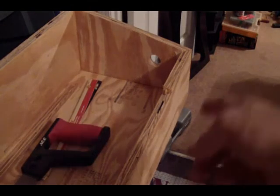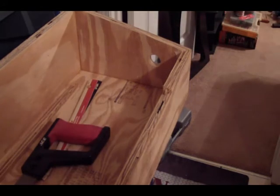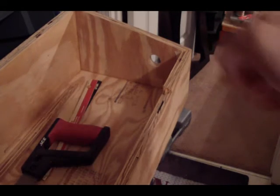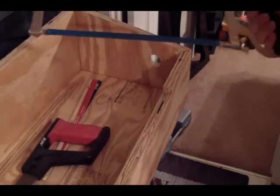Did okay on the first side, but this side over here, it's just the plies of the plywood are grabbing the rough teeth so bad that I just can't get a forward stroke going, and that's the real cutting stroke on that saw, is a forward stroke, and I'm afraid it's gonna splinter too much, so let me just get my hacksaw. Okay, got my hacksaw here.